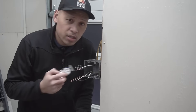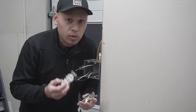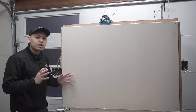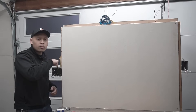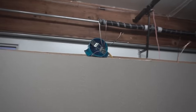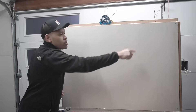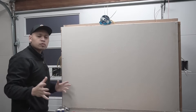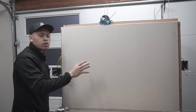Maybe you're working on a particular J-box, you took out the outlet, switch, or receptacle, and you accidentally didn't label it — now you don't know where it's going. In today's mock-up, I set it up with three cables going through this J-box, scattered behind the drywall, either leading up to this light fixture J-box, a random wire area, or that other single-gang J-box over there. Our goal is to trace where all of these go and label them.